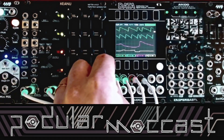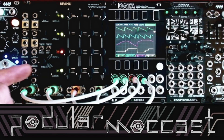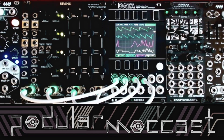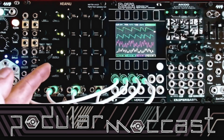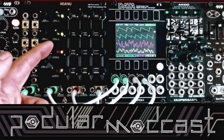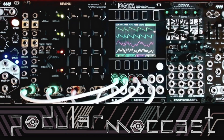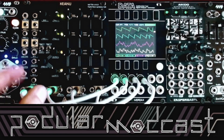Here's the meandering voltage on channel four. With slew all the way down on channels three and four, let me turn the frequency up so you can see — one is more square shape and one is more triangle. But you can add slew to each one of those. What's really cool is we have different frequency control CV inputs for each of the three oscillators that make up the modulation source on channels three and four.